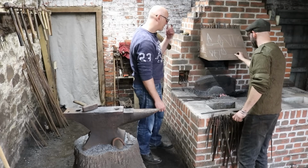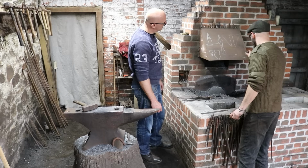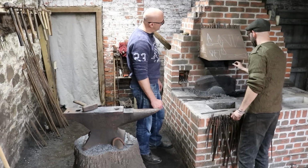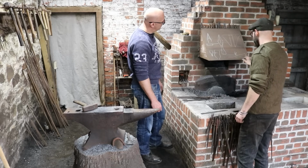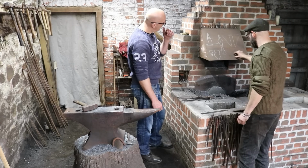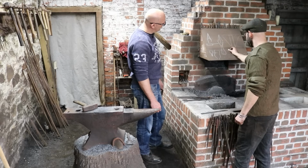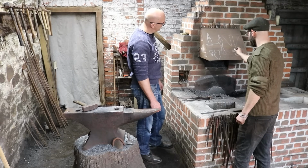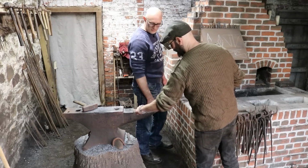We've got our round bar, and we've got the slightly odd ear sections here. And then we've got all of this openness in here. We want to bring all of that down by working here, ignoring this, otherwise it gets too tight. As soon as it's a flat round bar going into a wide section, that area then needs to be brought in even further to get that happening. And that dip there, all of this area is done here.